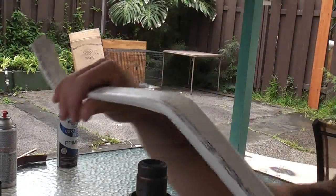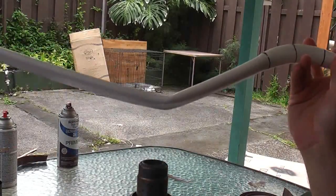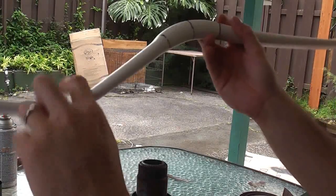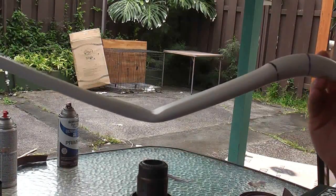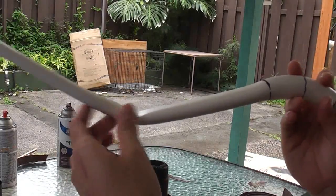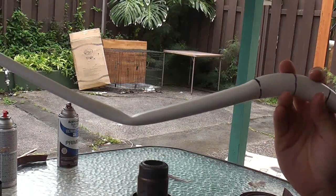What we're going to do is take our pipe here — you can see this is the collapsed area. We're going to turn on our heat gun and gently heat this area. You want to heat this entire area so that the pipe will puff back. You shouldn't have to press the sides to get it to form back — just let it do it on its own.